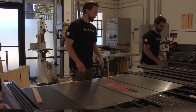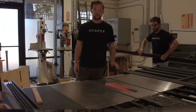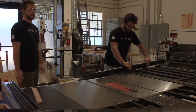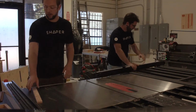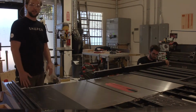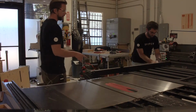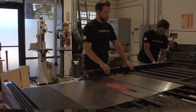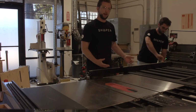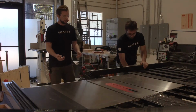We're fortunate to have the sliding attachment for our table saw, which allows us to do really, really long crosscuts when we're doing full timber crosscuts that are wider than our miter saw can handle. And it's a really great system. It can be set up in this version, which is the traditional setup, or the European setup, which is the fence in front of the material in the European setup and behind the material in the traditional setup.